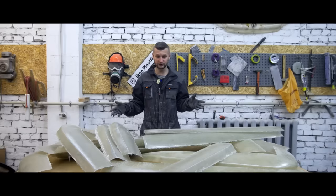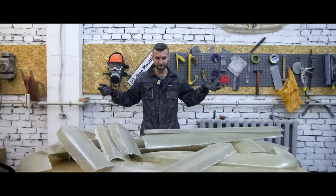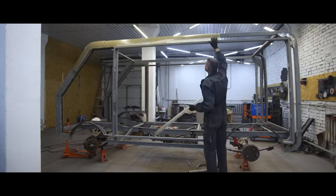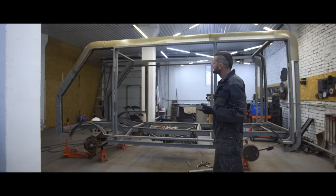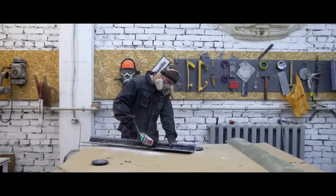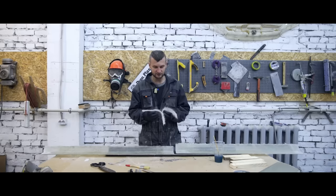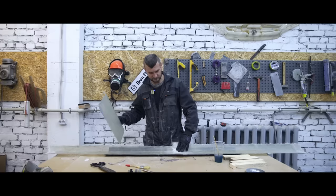After a week of work, we made this pile of parts which we need to connect and install on the van's contour that's gonna light up. The van is gonna have three large parts — one in the center and the side parts. We decided not to make a huge single part because it would be too hard to make. To join the straight parts together, I'm gonna glue them in the matrix using a thin piece of fiberglass mat — ripping the 300-weight mat in half since we don't have 150. We put the parts on top, then another soaked glass mat piece to clamp it all together.